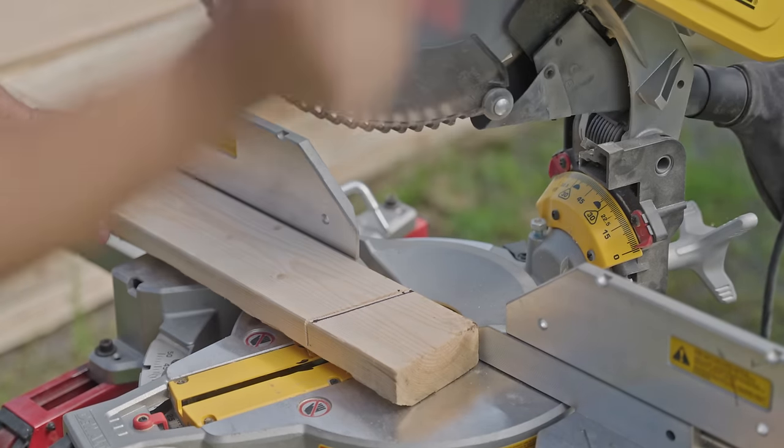And then we're going to have a roof that's totally supported, because this kind of roof, when it's sitting against the ridge like this, has an outward force right here at the bottom. If this is tied to the wall, it won't disengage, but it could still open up, okay? That's why we've got to get these cross ties in, so that we've got some stability and it doesn't happen under extreme snow load. And if we're both walking around up there putting on the sheet goods, we don't want to collapse our roof.